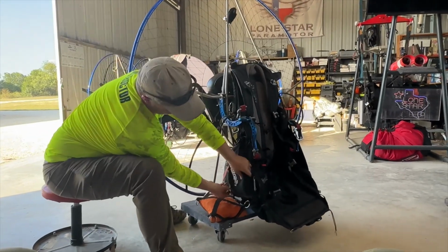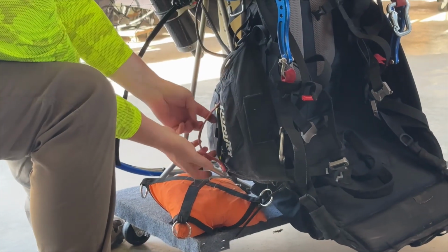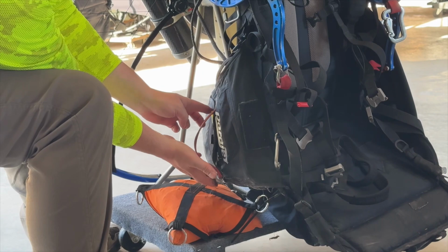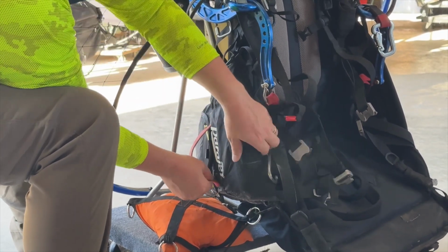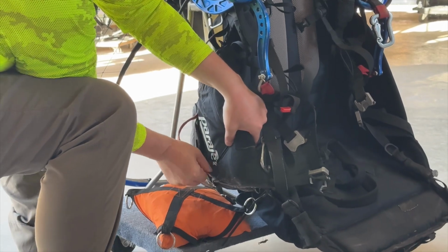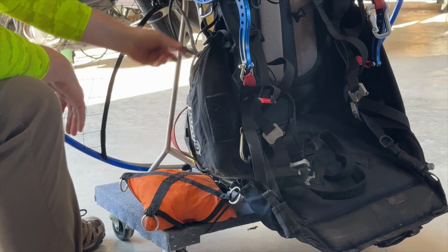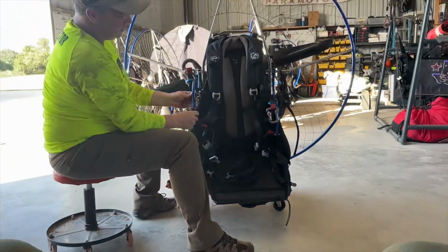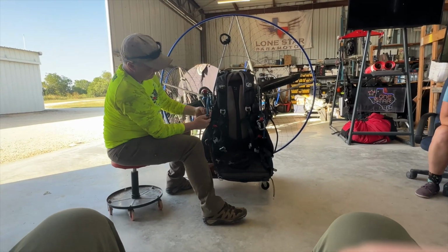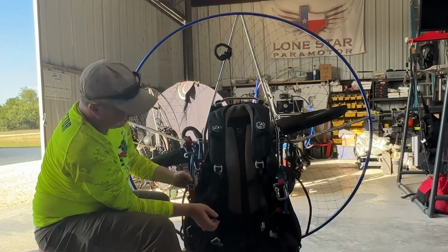This is the check here. This is the common piece I was talking about. So one of those will come out. You can make sure that they're tucked in, and then this green piece of what looks like a trimmer line is tucked into their pockets. It's not spring loaded, so it's not going to just fly out. Once I'm done with that, I'm about to transition to the other side of the check down, but I check this clevis, make sure it's safetied in, and follow it down.